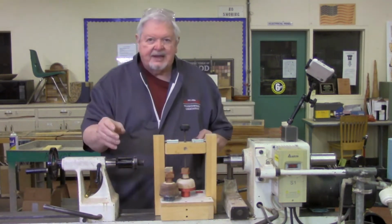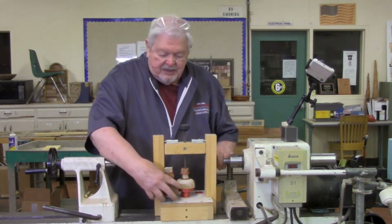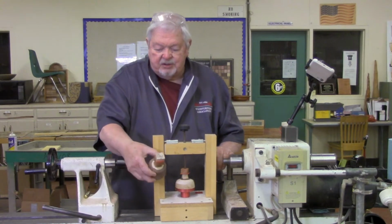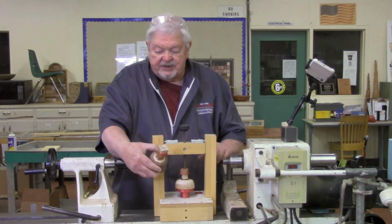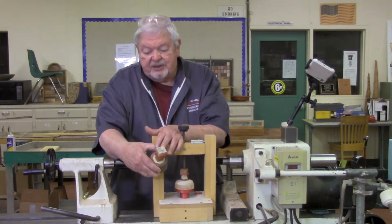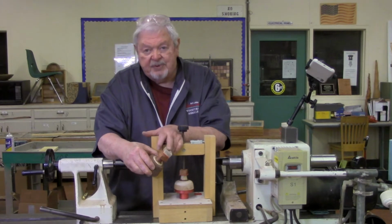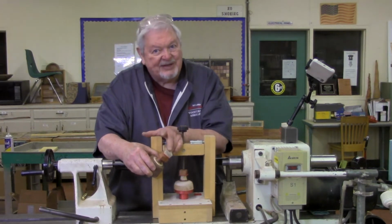I told you that I had to put these in clamps when I'm putting veneer in. So here's the base, all glued up. I've got red veneers between the bottom, redwood burl. I turned it a little bit here, the purpose of which is so I could get it flat and glue on my buckeye, very similar to the one we just laid out.